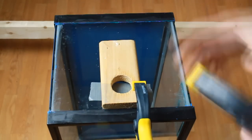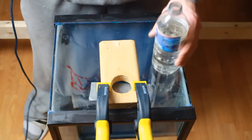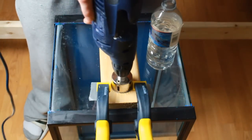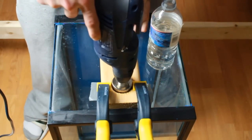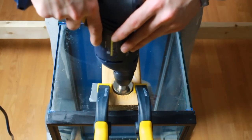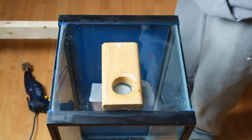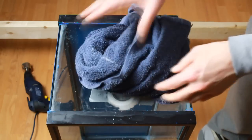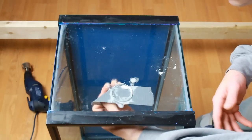This piece of duct tape is strong enough to hold that piece of glass from falling and not allow the drill to actually drill through the tape as well. With both in place and everything clamped down, we can go ahead and pour some water inside of the hole. Now because we're using a gasket and clamping it in place, the water is not going to go anywhere — it's going to stay in place. You can place the actual drill bit inside of the guide and start drilling. Starting off slow and holding it level — you don't have to start it off on an angle, just hold it level. Go nice and slow at first and then you can speed it up. A 6mm glass should only take about 60 seconds or less to drill. Anything thicker like ½ inch, which is 12mm, should take no longer than 2 minutes to drill. You're not applying any pressure — you're just letting the weight of the drill do all of the work, so don't push on it.